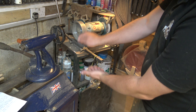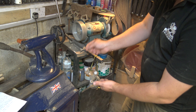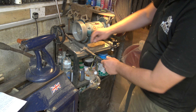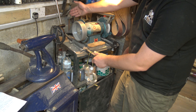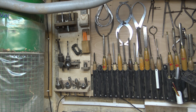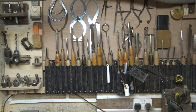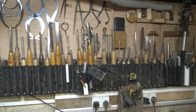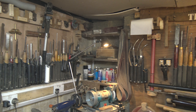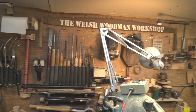When you position your grinder, make sure you've got full and free movement so things like the headstock aren't going to get in the way during the grinding process. Just make sure you've got enough space behind the grinder to extend any jigs you may have, as well as space in front to use those jigs correctly. In terms of storing your tools and accessories, ideally you want them within arm's reach so it's a really quick transition when you need to change tools.